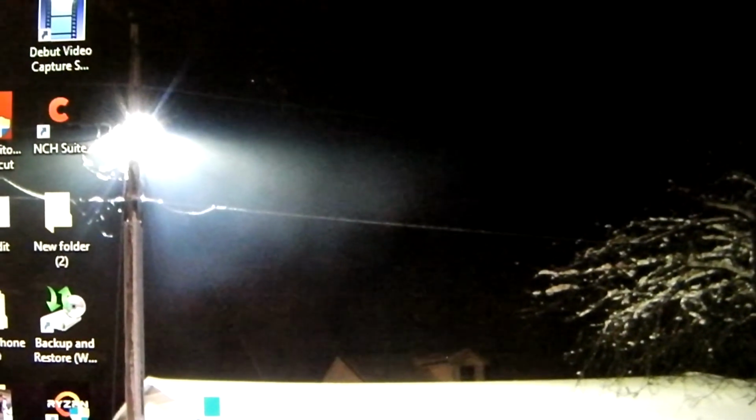But in a case where the unit is undersized and is running constantly all the time, even at pretty mild temperatures, and the thing has a time temperature defrost board set to 30 minutes, I mean, you'll have a high electric bill. And just the time temperature defrost thing alone is, single-handedly, the biggest thing that annoys me with heat pumps. Why are so many of these manufacturers still using this logic? Not only does it use a lot more electricity, but also it's harder on the unit, because the thing is having to shift back and forth between heat and air conditioning a lot more often than it would otherwise have to do if it was only defrosting when defrosts were warranted.